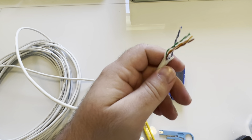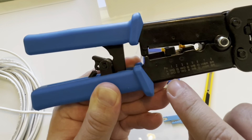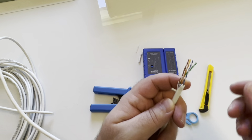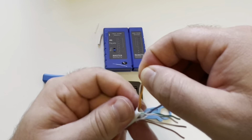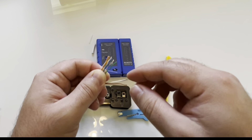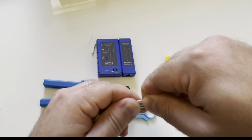Let's get this cable ready to crimp. I'm going to take scissors and cut off the jacket, cut off the divider, and cut off the rip cord. Now we're going to untwist these cables and get ready to crimp. A handy feature of the crimp tool is that it has the color codes listed on the tool itself. There are two networking standards that are most popular: 568A and 568B. I'll be using 568B for the house. The correct color order is: white-orange, orange, white-green, blue, white-blue, green, white-brown, brown — from left to right with the pin of the connector facing away from you. I'm just getting everything lined up and straightened out, using my fingers to hold everything together before sliding the plastic crimp connector over the cable.